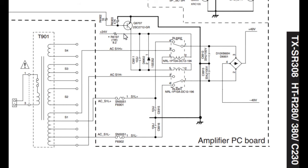So when you turn the amplifier on, these two relays in their default state power the amplifier through the inner taps, and these inner taps are fused. Assuming everything's okay, the microprocessor will then switch this transistor on. This is from a signal called SEC1H, which then switches these relays into the other switch position, which takes the full AC power from the outer windings of the transformer, smooths it, rectifies it, and powers it into the amplifier.